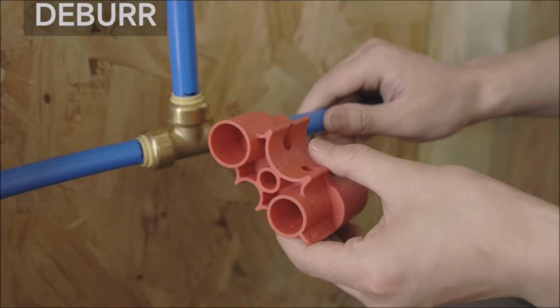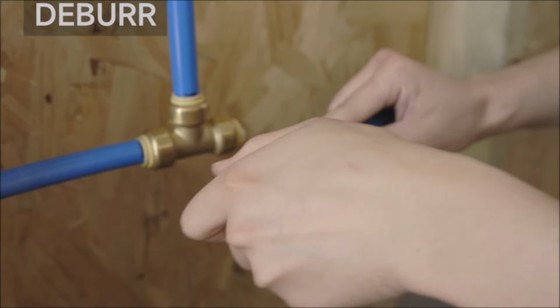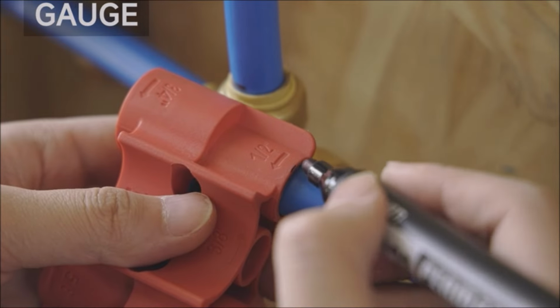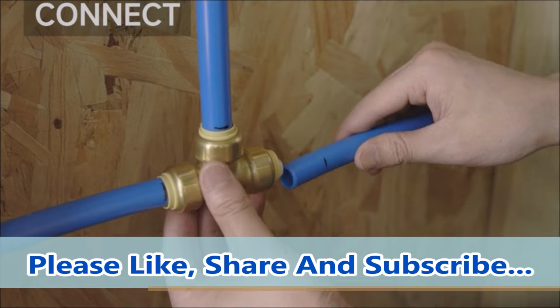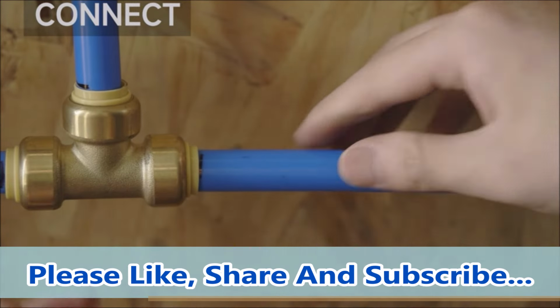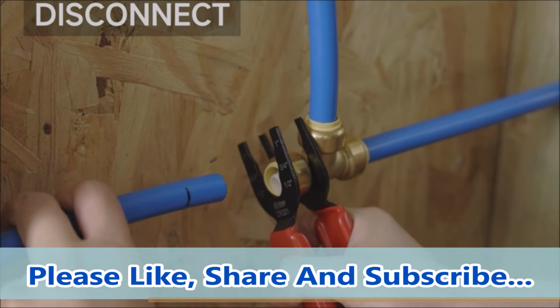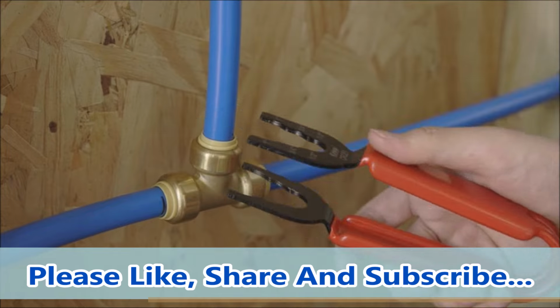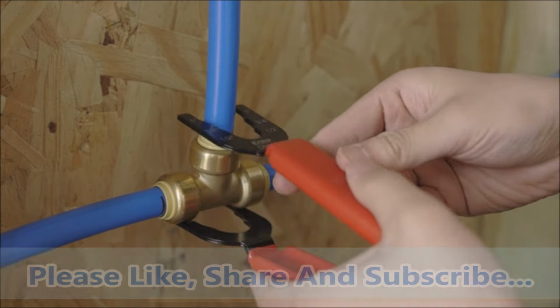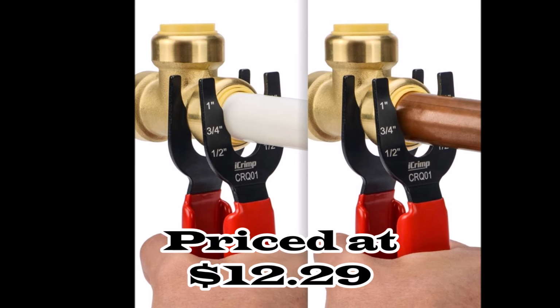To use the disconnect tong, simply slide it over the fitting and the pipe. Then squeeze the tong to press the fittings collar and pull the pipe from the fitting. This process is made easier in tight situations where traditional tools may struggle to reach. The disconnect tool works by depressing the release collar using the force supplied by your hand, allowing the teeth of the fitting to release and the fitting to be removed. This reduces the risk of installation errors and ensures a smooth disassembly process for brass push-to-connect fittings.